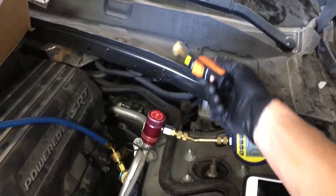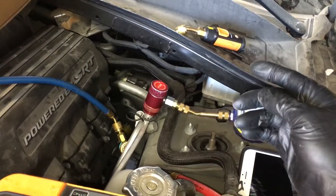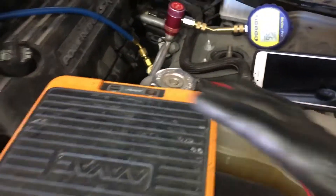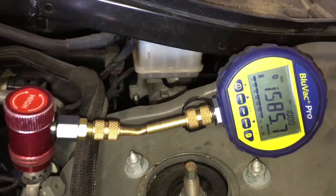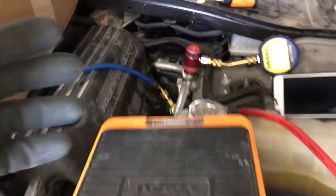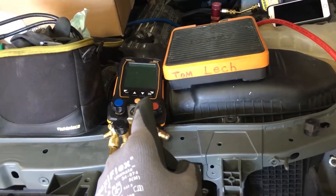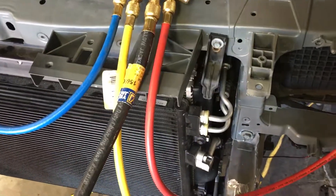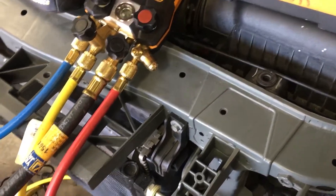This is another problem with some systems where somebody puts a micron meter down here. After you isolate and shut off, your system will balance out and your micron meter will raise. I just shut off the vacuum, so the system is going to stabilize between one side and the other side — and as you can see, it's going up. This was in a body shop with PAG oil inside, which is really hygroscopic. It's been a week since I did a recovery, and this is one of those places that takes hoses off and leaves them dangling in the air absorbing moisture. There's not much I can do — there's so much moisture and contamination in this, vacuum won't do anything.